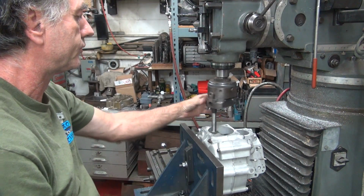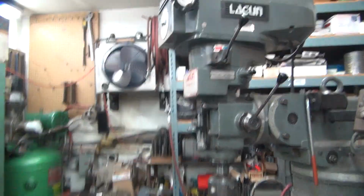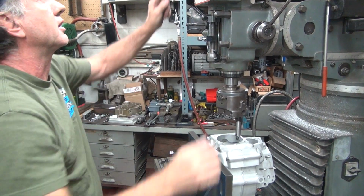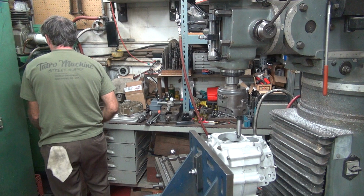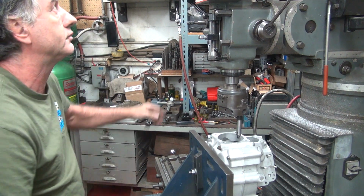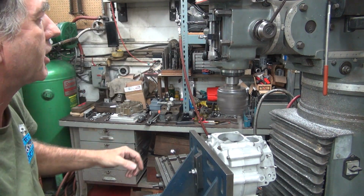Okay, should be good. Alright, we're at 1500 RPM right now for cutting. Oh, I need to engage the gearing. Okay, gears in. Let's turn this thing down to about 1200. Oh, need some power. Power. 1200. Power feed.